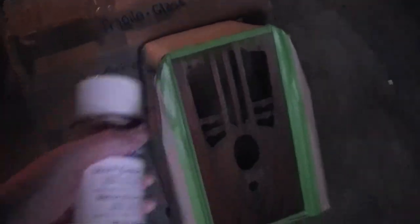Alright, so enough talking. I've got this shaken up really well. I'm just going to do one really light pass — top to bottom, left to right. If that's good enough I'll just stop right there; otherwise I'll put on another light coat. One thing with toner lacquer I've learned the hard way: it's much better to put it on light and come back later for a second coat if it's not quite the right color, than to try to remove any. It's so easy to put this on too heavy and too dark, and then it looks terrible and you've got to strip it off and start over again.